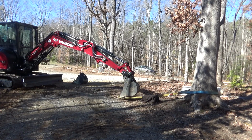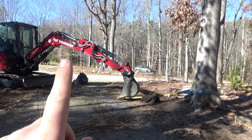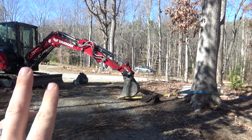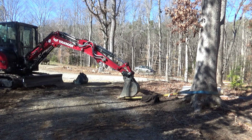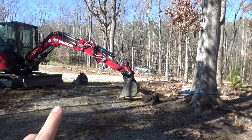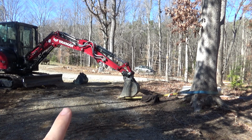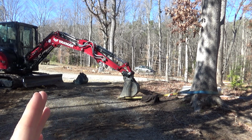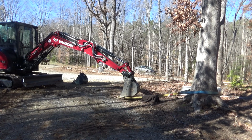Okay, so when I was close and had the boom almost in an A, so more of a straight up pattern, I was getting about 5,500. I couldn't get much more than that, and I realized that wasn't right. And you try to figure out, how are these manufacturers getting such high numbers? Because I couldn't overcome the arm. So as you saw in the video, the arm, as I was curling, the arm cylinder was what was letting go. And so it wouldn't allow me to do more pressure.